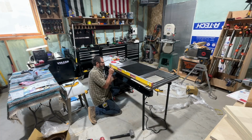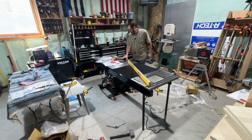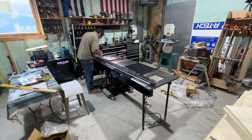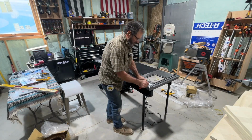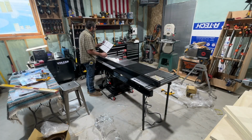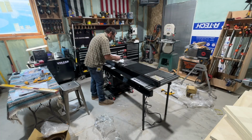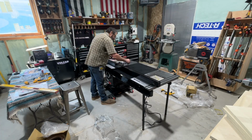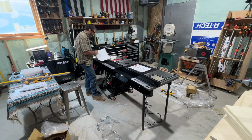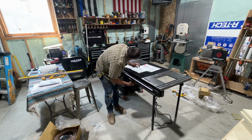and then when I was making drawers, I could do the dado, depending on what size the bottoms were. I usually put half-inch bottoms. I know a lot of guys use quarter-inch, but I use half-inch bottoms. So I would run a half-inch dado using my router, and instead of putting a dado blade in the table saw, I could just use my router and run it right through there, and it really did a nice job. So I'm kind of excited to have that again. I've kind of missed having my router to do all kinds of things, but yeah, that's one of them.